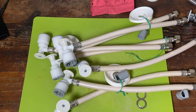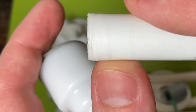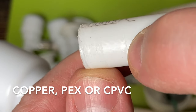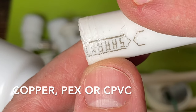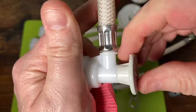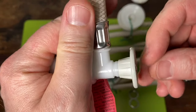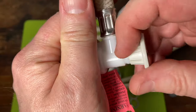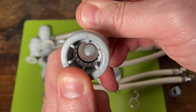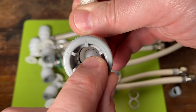The one thing this does is it trashes your pipe. So if you did this to copper thinking you're going to put an O-ring back on it, it ain't happening. That pipe was smooth just a second ago. So this being the on and off — this is on right now. You have to pull this out to turn it off. I've seen this break when people are trying to push-pull. And then all it really is is an O-ring in there. We'll cut one of these apart real soon, but you can kind of see that O-ring peeking out back there — that's the only thing that's sealing it.